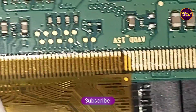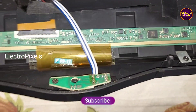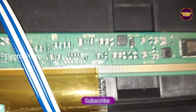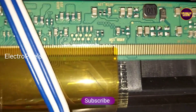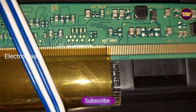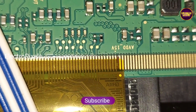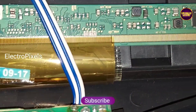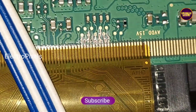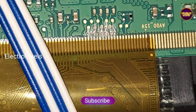You can see these are the gate signal tracks from the right side of the panel. I am planning to first cut down the right side gate signal tracks. Here I have cut down the right side gate signal tracks. Now in this condition, let us turn on the TV and check the picture to make sure that the complaint is solved or not.